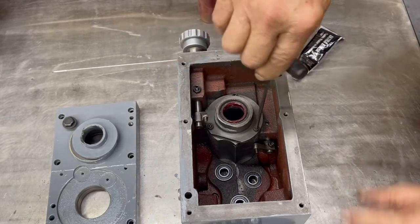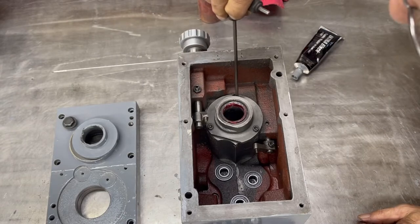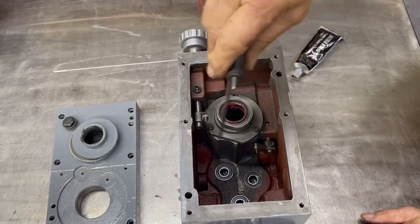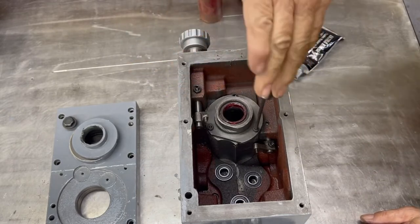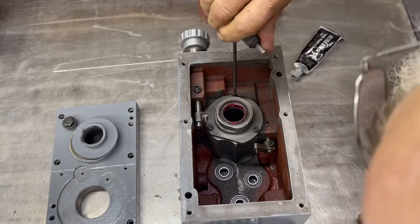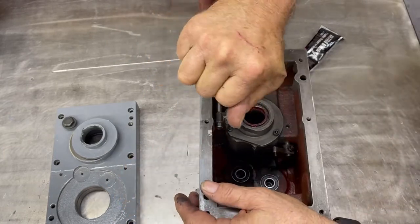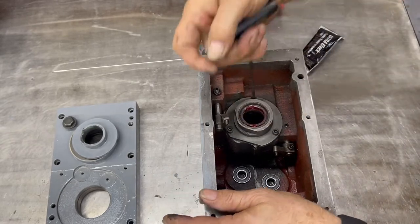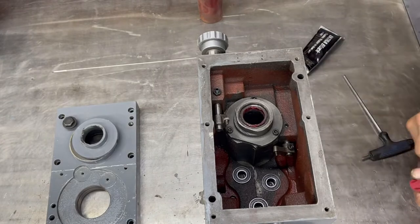The thing is, a flange like this that goes down into a bore, you got to get it started real straight. And I am actually pulling it in with these screws. It's a little tight. Not enough to worry, but you just walk around, watch that thing settle into its little hole. I think that young man that put this together put too much sealant in it, but that's all right. And these just got to be good and tight. All right, very nice. So there's that part, the hub and seal in place.